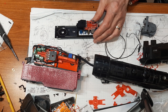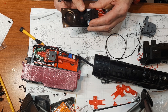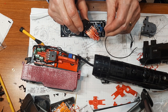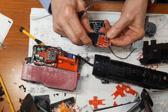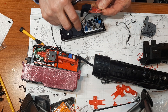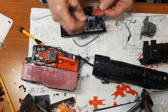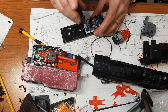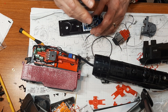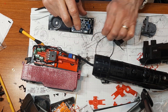Another thing to mention before you put this on: the motor control board's power comes from here — positive comes from here — and it's going to route down to this positive, which is the outside piece. You're going to want a small piece of wire — something like this — going from that positive right there to this positive right here. You loosen this up, push the wire into that opening, and clamp it down. Make sure it's tight — give it a little tug.